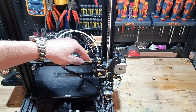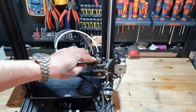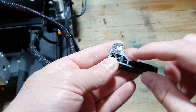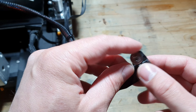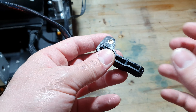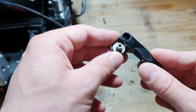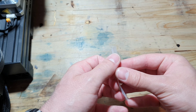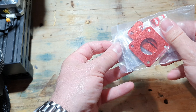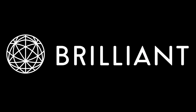After around 10 hours of printing, something happened that happens to probably every Ender 3 printer — the extruder broke the small plastic piece. So I had to change it. I already glued it with some super glue and used UV resin to strengthen it a little bit, and used it for another test piece to see if everything fits. But before printing the large housing again I will definitely replace it — I don't want to risk the print failing after 10 hours again. I ordered an aluminum extruder on Amazon, which is pretty well received in the community.